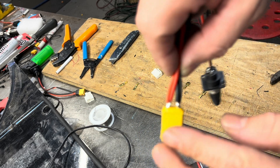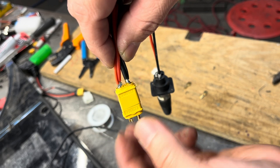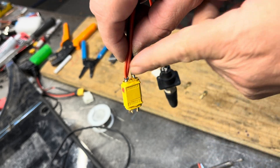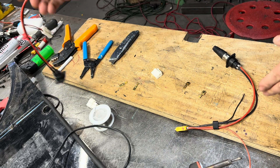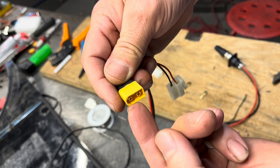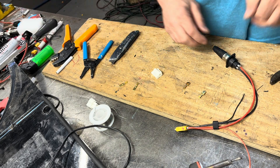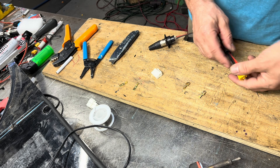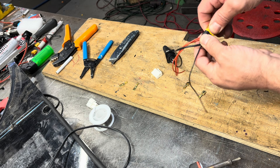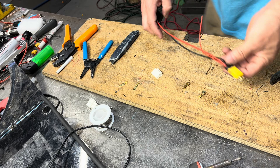I'm going to put a little bit more solder just to wrap it around a tiny bit — a year or two from now I won't have to worry about it. I wrapped that around nice. Get it nice and flat so I can put the black cap over it. I just wrapped the solder around slightly. These pins — you can't pull the pin out until they cool because the pins have to stay lined up. When they're really hot if you don't have a cap on they'll be crooked, so you put the cap on and push it down.